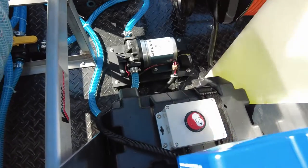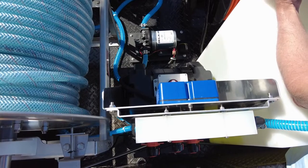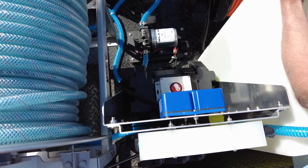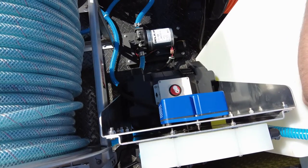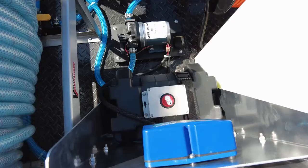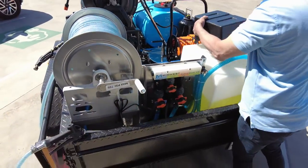On this particular soft wash setup we're running a Delavan at 100 PSI at 26.8 litres a minute. That's mounted on a bit of polypropylene up above on vibration isolators to further dampen vibration and allow quick change of consumables. The Delavan doesn't have an onboard switch like the Everflow, so we have a remote switch. You can see the battery charger there — it's a dedicated 120-amp-hour deep cycle battery which sits below and will run that particular system.